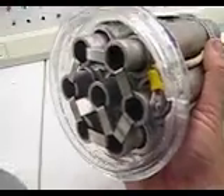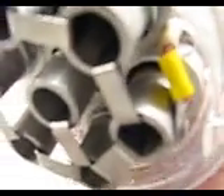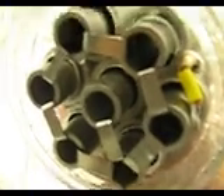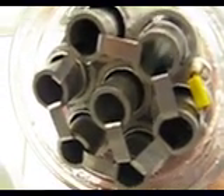This thing is heavy. With tiny pieces of stainless steel plate that I bent on each end about 1-inch in, they touch each of the insides on the 1-inch pipe and make the negative connection. I then drilled a small hole through one of the pipes and attached a wire, which runs up to the top of the cell. Eventually, that will hook into something — I don't have a case made for this yet. Those clips are bent over a certain way so as to be like spring steel, so they hold each other together.